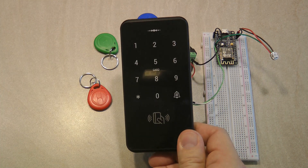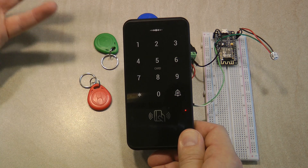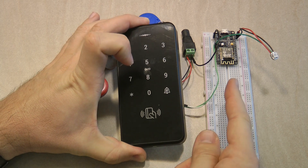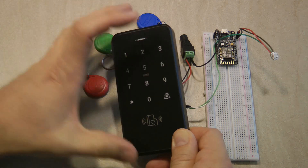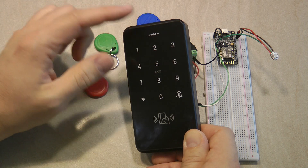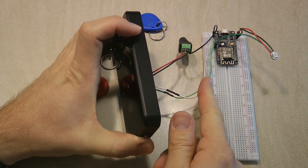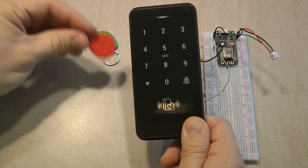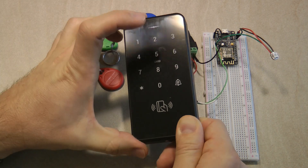The way I wanted to do this in Node-RED is to use this unit only as an entry device. I'm not going to use the built-in features — I just want a nice-looking keypad and RFID reader that sends data to Node-RED. Node-RED is going to decide if you have access and whether the door opens. I managed to configure the unit just as a reader using basically two cables and a couple of libraries, then put the information on MQTT and built the solution in Node-RED.